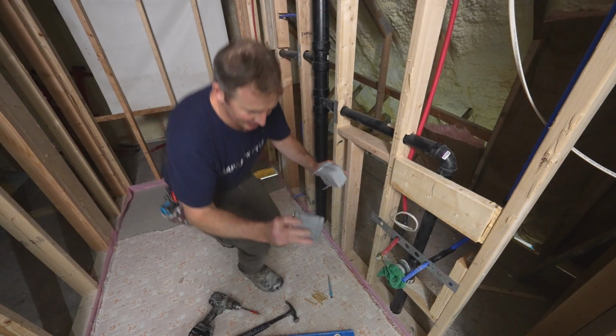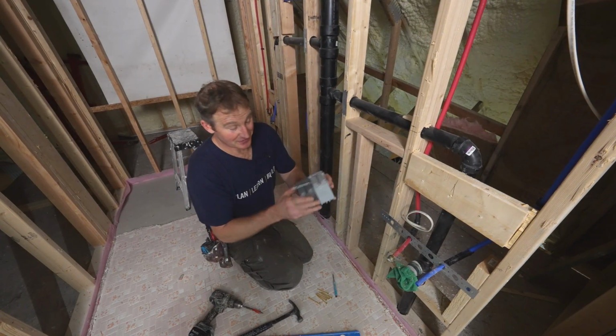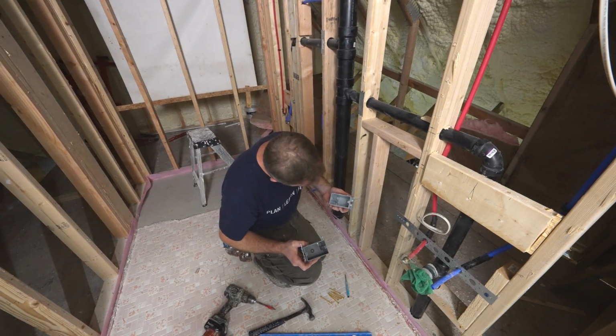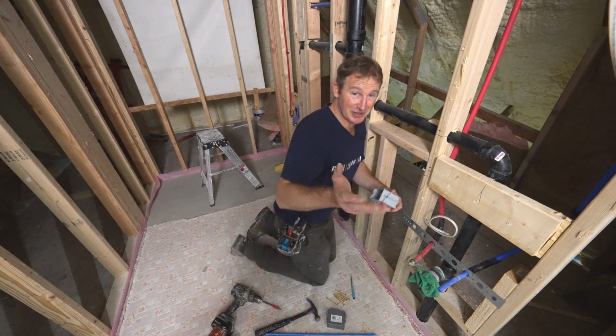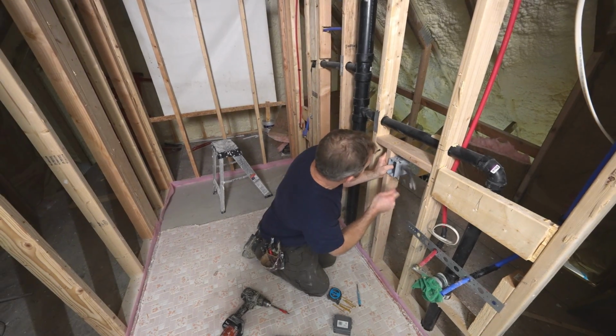All right, so same thing here. They have bigger boxes here. So GFIs are very bulky. So I would recommend getting the bigger boxes. This is the 18 cubic inch, and this is 23 cubic inches. So you get a lot more space out of this. I definitely recommend that, especially if you're running 2 wires like we are, to go over to the bidet toilet seat.